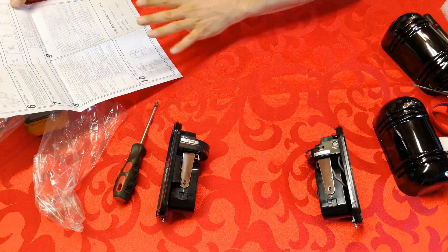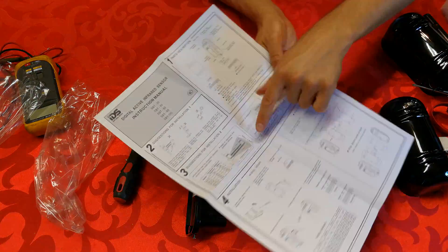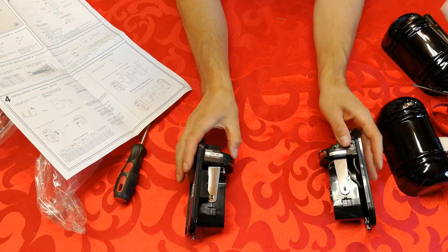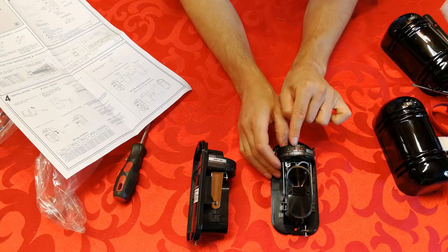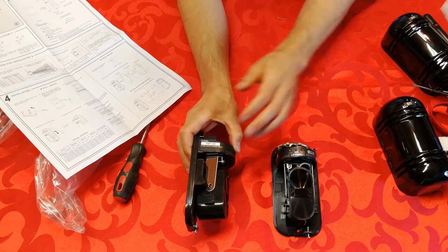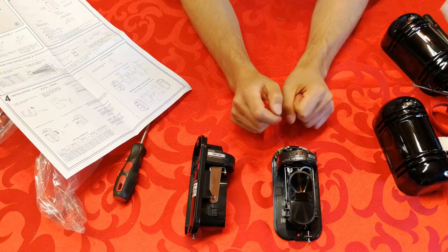Although it is a focused beam it still has a fairly wide beam width, as shown in the instructions. The zone of infrared leakage is quite wide, so in my experience even when people install this slightly skewed it still picks up. On good beams there's a level indicator showing it's picking up the sender at the correct level, and a signal LED confirming good reception of the infrared.